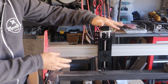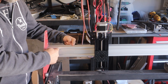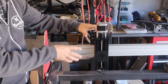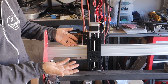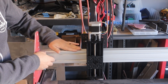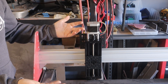The X axis runs on this extruded aluminum rail. I bought this from Automation Direct — it's a one-and-a-half inch wide by three inch high rail. You can order them imperial or metric. Looking back, I probably should have ordered metric just because all the other hardware and mounting is based on metric, but I'm making it work. You can order this to specific lengths — you tell them what length you need, they'll cut it to size and ship it to you. I actually ordered it an inch or two longer than what I thought I needed, just in case my measurements were off or I had to make an adjustment.